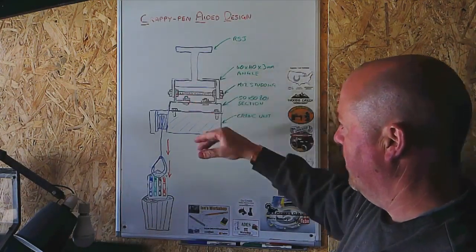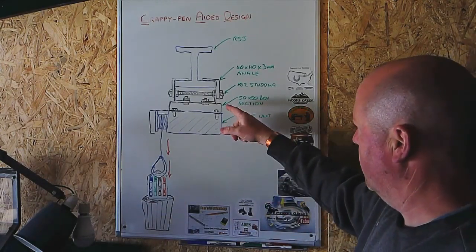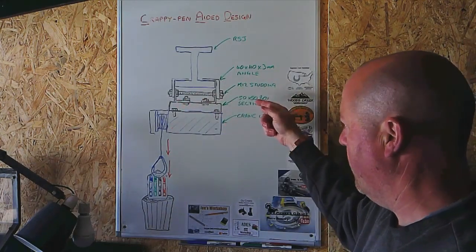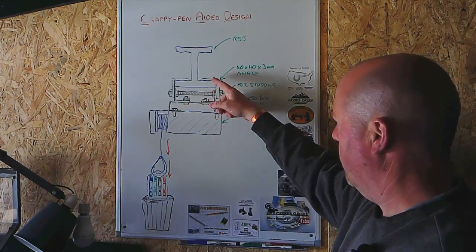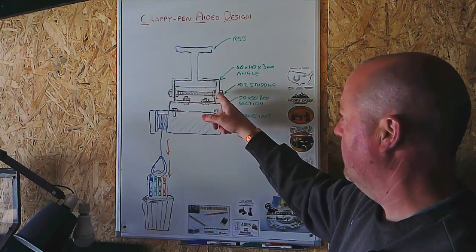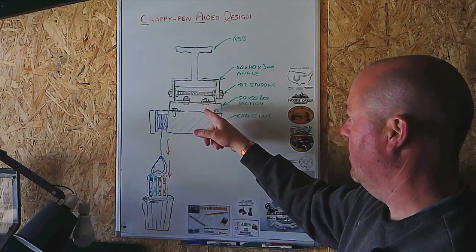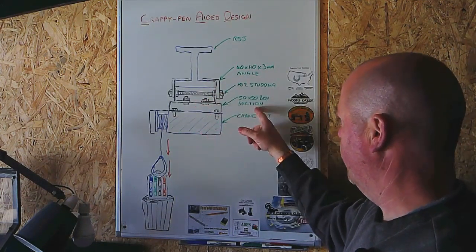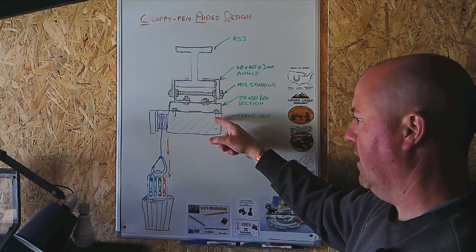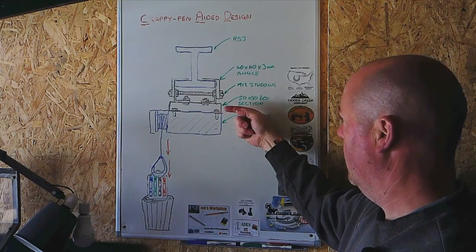So I'm thinking this will be sort of 300 millimeters long in total, so probably three M12 studs down the length of the thing, through 2 sets of this angle iron bolted from both sides, which will stop any tipping movement, so that it can't tip under load. Some 50 by 50 box section with the bolts running through into the crane unit, and access to tighten those bolts will be from the end down the end of the tube.